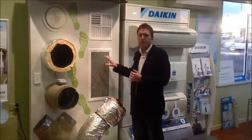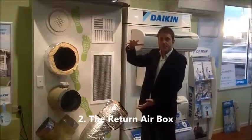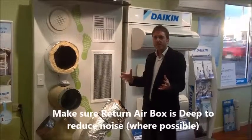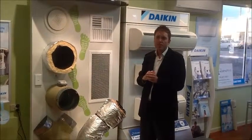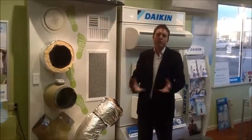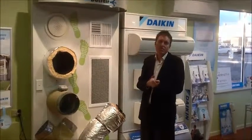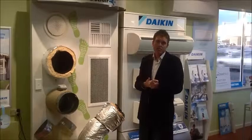On top of the return air vent — the part that we see — there is a part we don't see: a box, a return air box, which is where they connect the duct. It's really important to make sure that box on top of the vent is of a decent height. We see a lot of boxes that are very shallow, and what that does is create a stirring of wind around the box and generate noise. By having a nice deep box — in this case around 390 to 400 millimetres high — it helps to reduce the noise heard down on the ground.